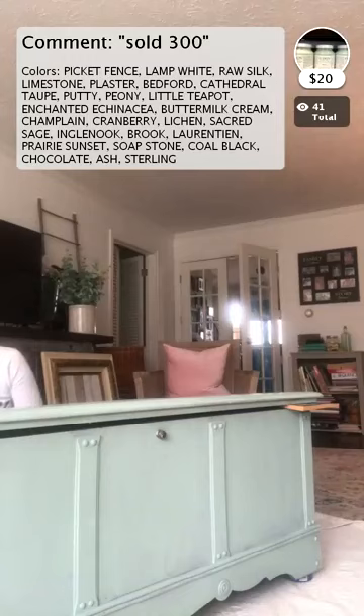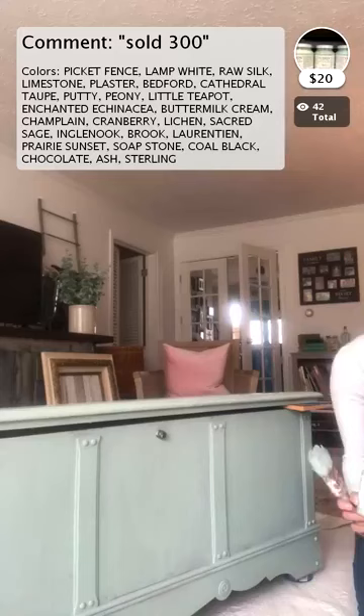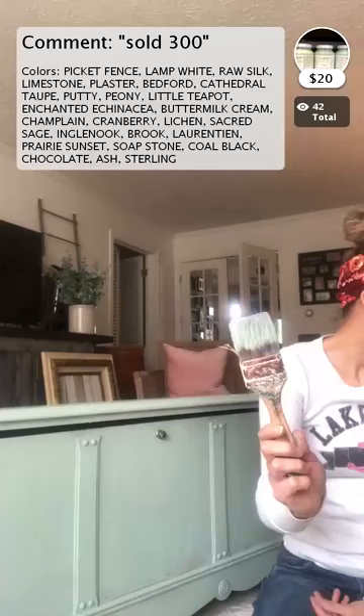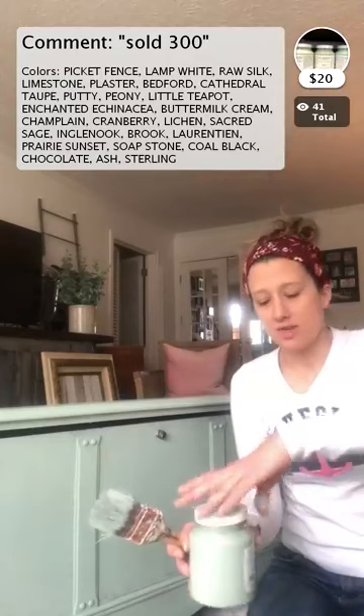I only have the arthritis in my hand when I paint for a while. In about a half hour this will get a second coat. We have both the large two-inch and the small inch-and-a-half brushes for sale. This color is Brooke, and I lightly sanded the whole piece mainly just to give it a good cleaning and to scuff up the surface so the paint has something to grab onto. Then I cleaned it all again, and the paint grabs nicely when you have a slick surface that's been scuffed up.